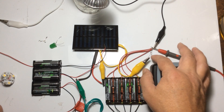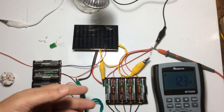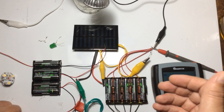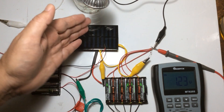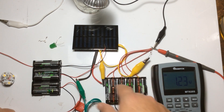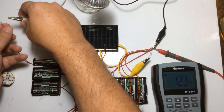That voltage goes in through a diode, because for those of you who aren't aware, if you don't have some sort of diode or voltage management regulator off a solar panel — like a charge controller — then the voltage can reverse. During nighttime, or if the battery voltage dropped enough that it wasn't outputting sufficient voltage, that current would go the opposite way, coming out of the batteries into the solar panel and being burnt off as heat.